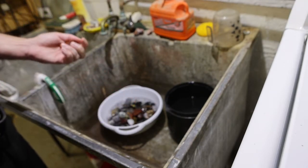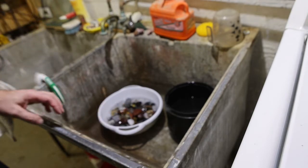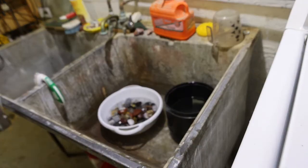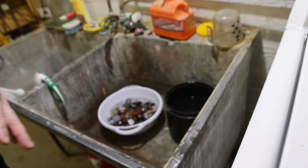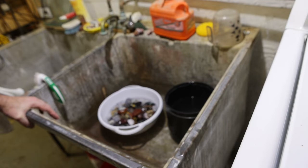Anything that needs to go back in step one goes back into the 12 pound barrel. One more thing - on my smaller barrels I've got writing: this one says rough, this one says fine. Step one is rough, step two is fine, step three is pre-polish, step four is polished. When I only had the double three pound tumbler I bought two more barrels and literally did that for cross-contamination - only rough grit in the rough barrel, step two in the fine barrel, and so on. The pre-polish and polished barrels are still over there.